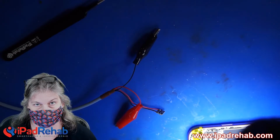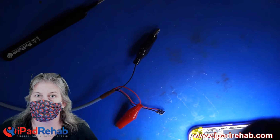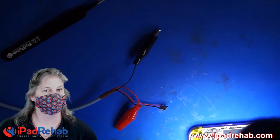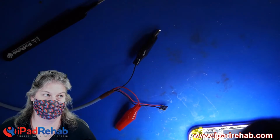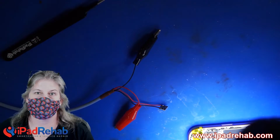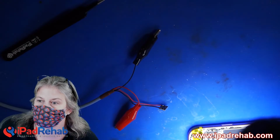This one is not going to be easy. We've done all that we could. We did cure the short circuit within the CPU, but it was not enough to bring back the function of the AP touch interrupt. The only thing I will do is stick a screen on it and see if you really let it boot up and let it go back to a completely sleeping, resting state. Do you need interrupt in order for touch to communicate to the CPU? It's possible that you only need interrupt at certain times when the CPU is busy, but maybe you don't need it if it's not doing anything. So let it chillax until it's not doing anything. That's the only other thing that I would try.